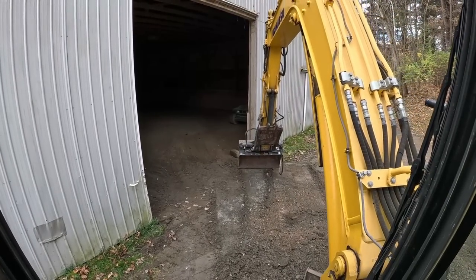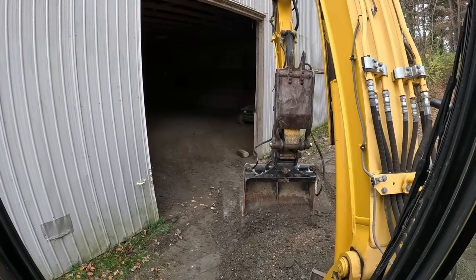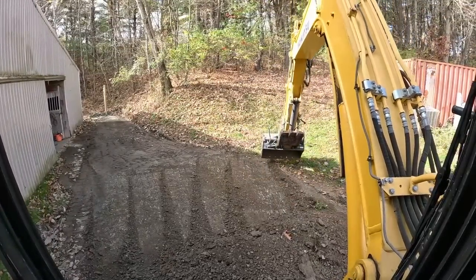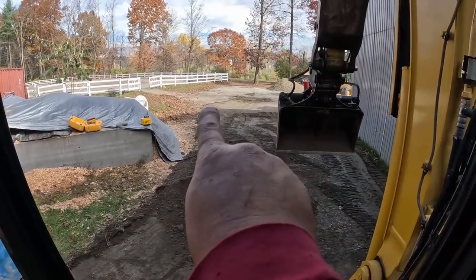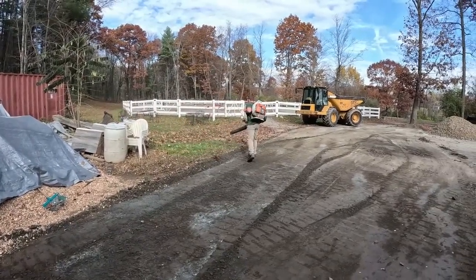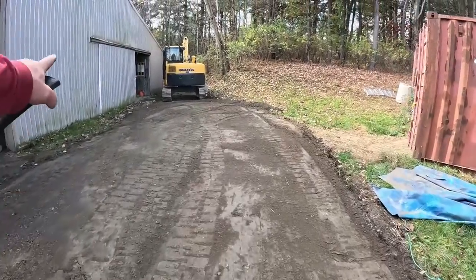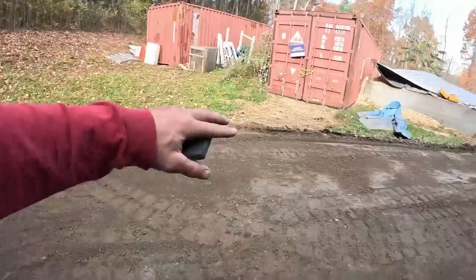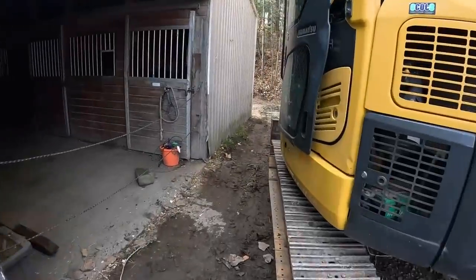There we go, good bite - break that crust up. We're going to put all new stone down. I just shot it with the laser - we got one inch, inch and a half. It's dead level the whole way back, but we need water to flow down there. We're getting a good grade cut here, about two inches of positive pitch away from that concrete. That floods out the first four stalls pretty good. So we've got two inches of pitch going there; worst case we create a swale in the center to get to our trench.